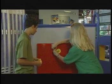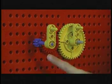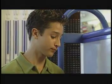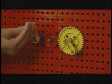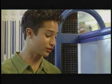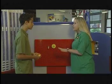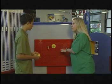What if there are three gears? Let's try it. Here we have a driver with eight teeth, a follower with 24 teeth, and another follower with 40 teeth. It looks like the driver gear goes around five times for every one time that the largest follower gear goes around. Good observation. To find the force multiplier, you divide the 40 teeth of the follower by the eight teeth of the driver. That would be five. But what about the middle gear? The middle gear doesn't make a difference, except for the fact that it changes the direction of rotation.